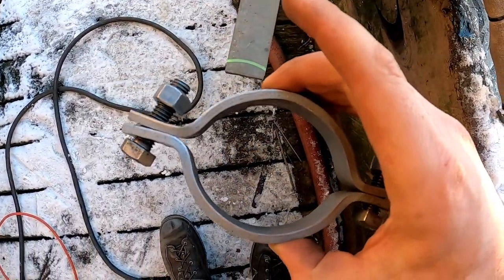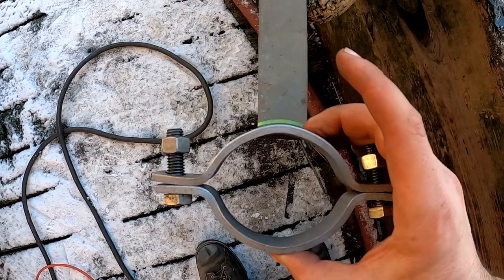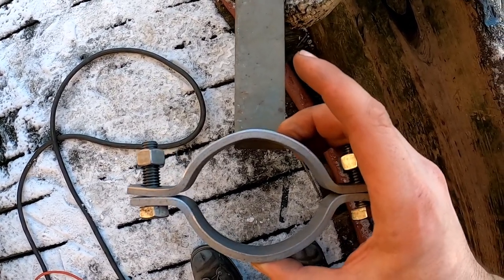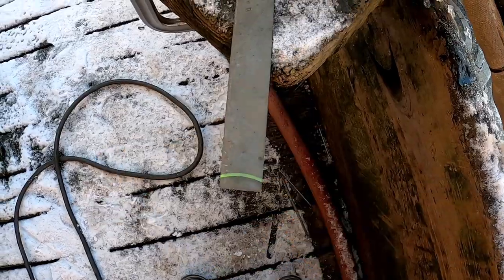This is gonna be a pipe hanger. Got to put pipe hangers on everything. You don't want things to vibrate down in the engine room. So I just traced that, pretty simple. Gonna nip that with the plasma cutter and probably use the wire feeder to get that on there. And that's gonna go down below in the engine room.